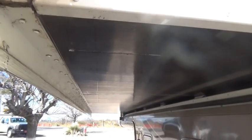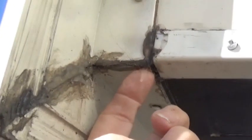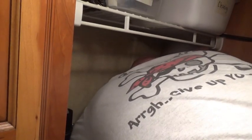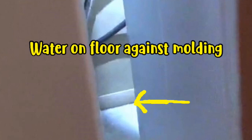This is the floor we had replaced that the insurance covered because we had a leak from the washer, and it's leaking at that. Could be this drain. That noise is the washer running. We're running a load to see if we can figure out where the water's coming from. It feels wet around that drain. See the water puddled up right there? And I think it's coming from this trap on this pipe. What it could be doing is that drain ain't taking the water fast enough and it's coming out the top a little bit.